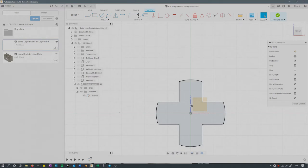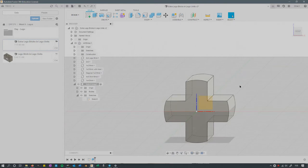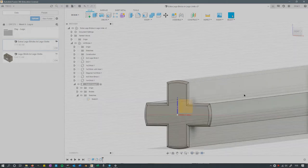Then obviously you extrude this. I'm planning for my vehicle to be three or four Lego circles wide, which means my axle needs to be longer. So I'm going to make my axle 6 Lego units — 6 times 5 is 30 total Lego units long. I extruded it 30 units. Then the only thing I did after that is I took the fillet. When I filleted, you could select all 12 edges, or you could just grab the entire face — I filleted the entire face, then filleted the other side as well. That's your axle.